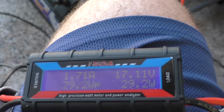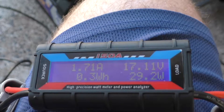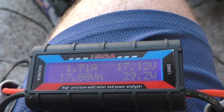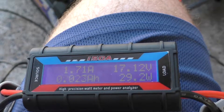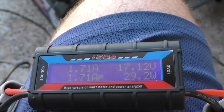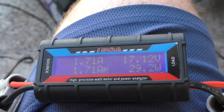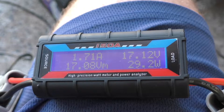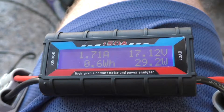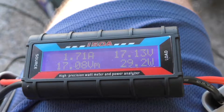When you plug in a higher wattage solar panel than it's made for, it will limit the power to 1.71 amps and 29.2 watts. Whereas with the 50-watt panel it uses the full capacity, which is close to 3 amps at best. The built-in controller in the PS300 will accept a higher power source but will not utilize it — it limits it even lower.